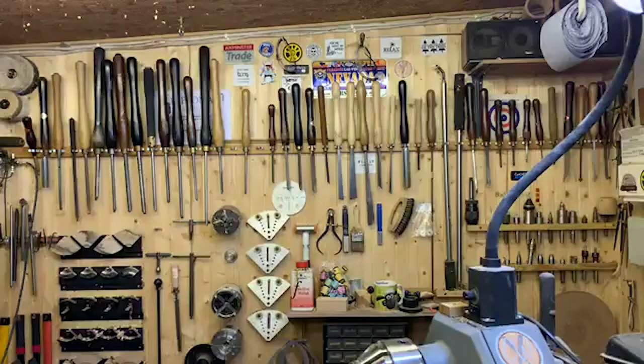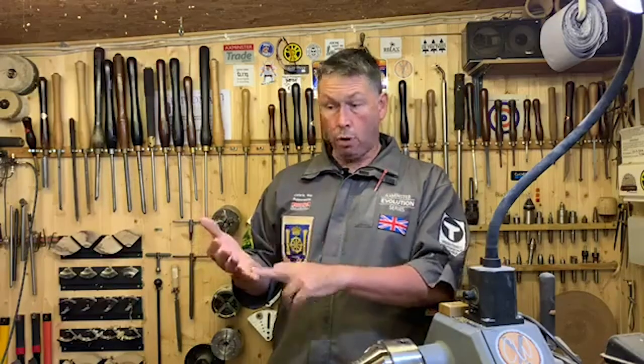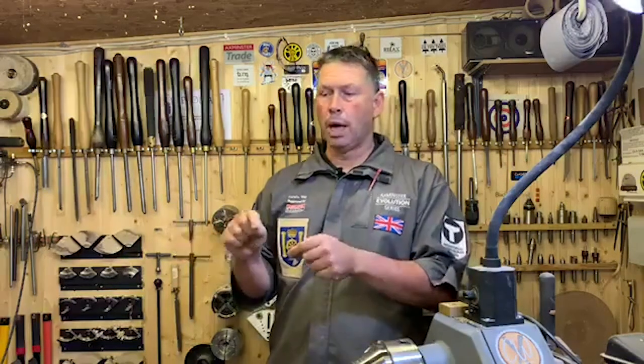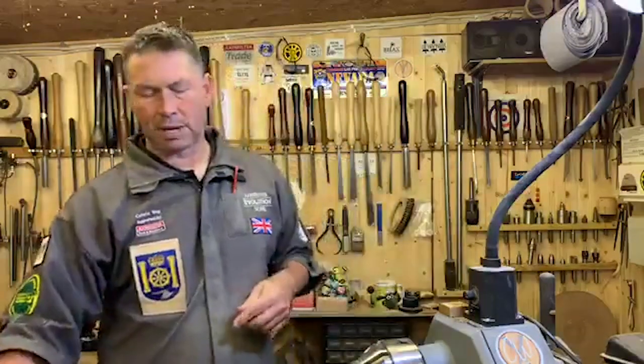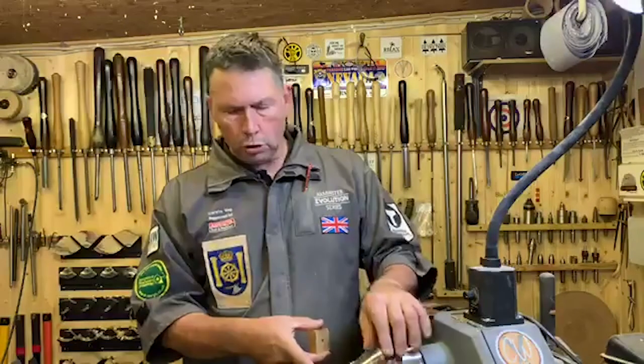So currently everything I'm using to make the carriage is oak. We've got one difference: there's a little bit of maple for the plunger, which we're going to make in a moment. Obviously the barrel's elm, and we're also going to use some beech dowel because it's a given thickness. I don't want to be turning 6mm dowels down, for instance. You can see the underneath here, we've got the actual axles. So 6mm dowels, easy, it's out there, it's relatively cheap. So we're going to use that push plate.